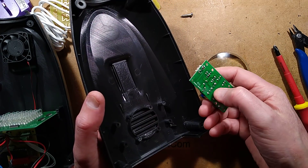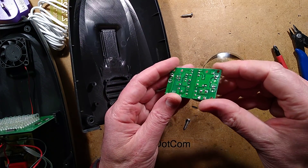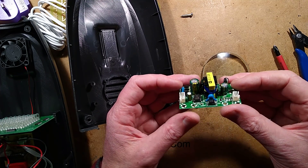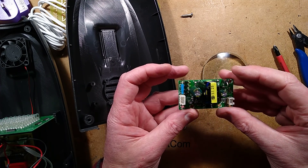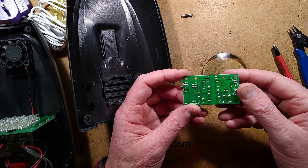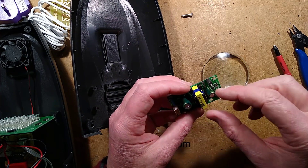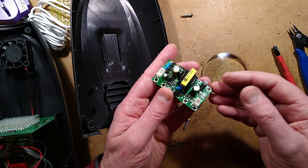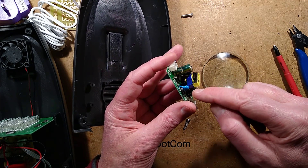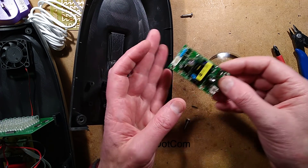It has a decent anti-tracking slot. The opto-isolator is in a good position - that's not bad at all. With a suspiciously small capacitor, but that's okay. It looks like a generic switch-mode supply with a sleeved fuse and well-spaced diodes - this doesn't look too bad. Now, that all depends on how the separation of the windings is. It's missing that one thing I really like - the double or triple insulated windings, where either they sleeve it or they have a heavy winding that goes around it, but they don't seem to use that.